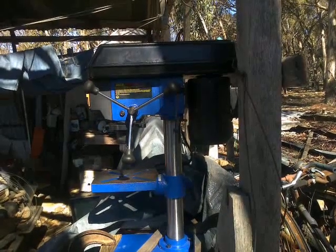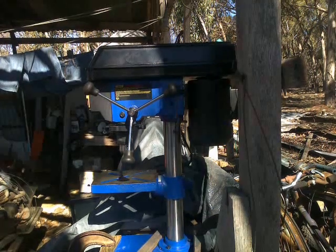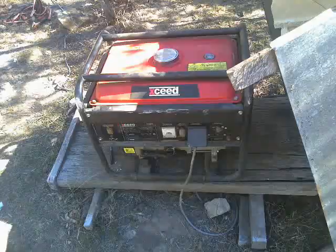But in curing the tip tracking error by packing the tips and getting the whole thing lined up and then drilling a shaft that was perpendicular to the tips, I made the hub wobble. So this time the idea is to drill accurate holes from the beginning. Now we start the generator to make the juiciness with which to run the drill press.